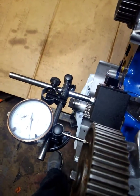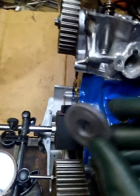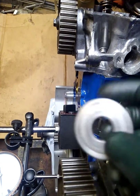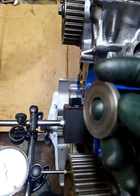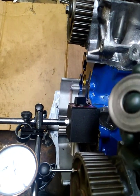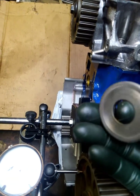So if you were binding and too tight, you would use the stepped side. If you're too loose, you can use the dish side, and then you remeasure and flat lap until you have the right specification.